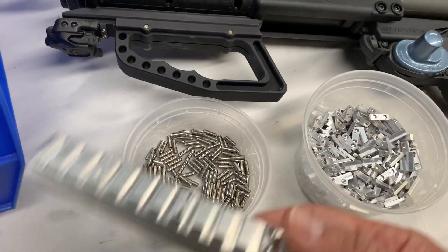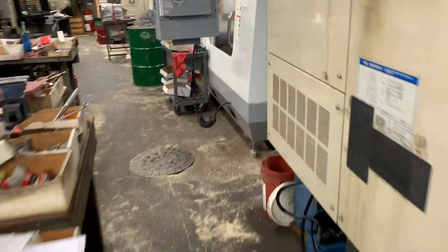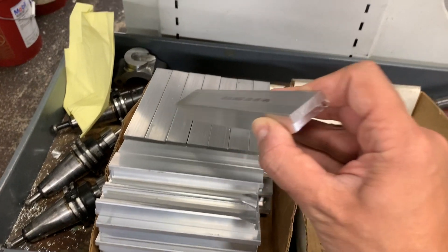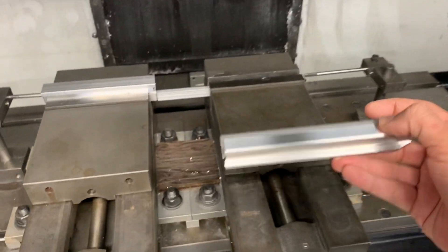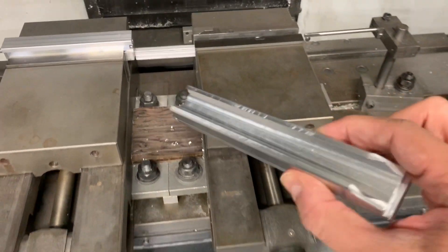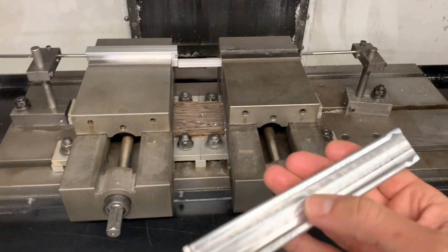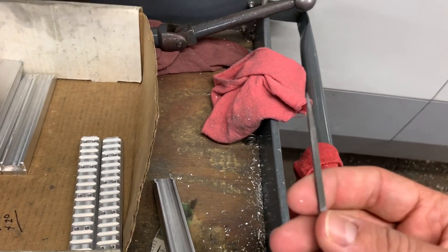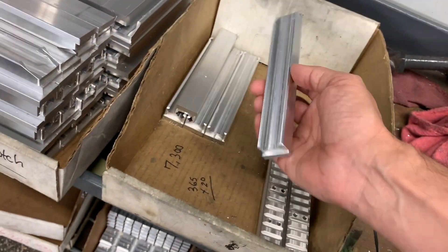All of this is made out of 6061 solid aluminum bar. Let me go to the machine and show you exactly how they're manufactured. They would normally come as stock rectangle solid bars like this. The first operation is to put it in the machine, and it machines the inside groove — see that groove? Everything is machined to precision tolerances, and we have gauges. Then we deburr all of this by hand, either with Brillo or Scotch-Brite. My guys have a scraper and we use this tool to remove all the sharp edges so it doesn't mar or dig into anything.